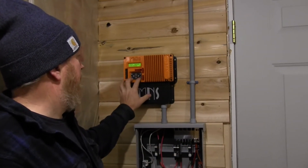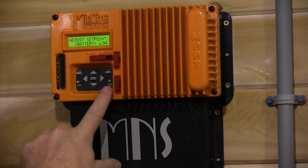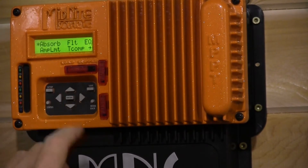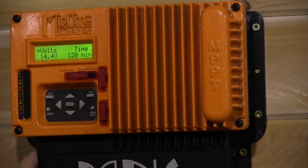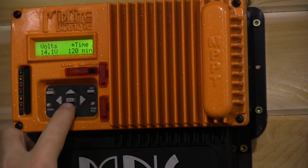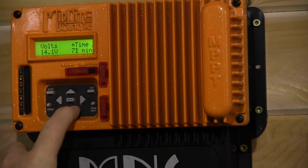The first thing we're going to do is go to the main menu and go into the battery menu. I pushed the little round button on the bottom labeled main menu, and if battery is not in brackets, go back and forth until it is, then press enter — virtually everything we're going to mess with is in here. So the first thing we want to do is go into the absorb menu. This particular battery is calling for 14.1 volts of absorb and 15 minutes of absorb time. A lot of lithiums vary on absorb time — some have zero, some have a few minutes — so this is critical to get correct.